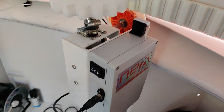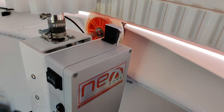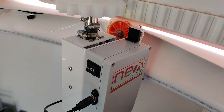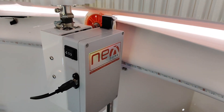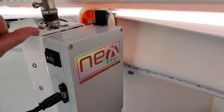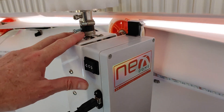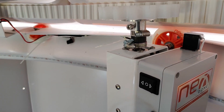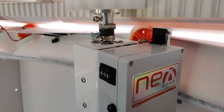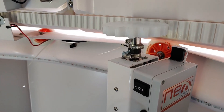The other mod I had to do was on the magnet sensor — it was just too far away from the track. I 3D printed a little spacer to bring it up closer to the track, and that helped pick up the home sensor. I wasn't doing that before and it was one of the issues I had when trying to set up the dome alignment. The other issue with the track was the original spigot where it sits on the gear was too short, sitting away off the bottom of the track. I 3D printed another spacer and stiffened it up with some jubilee clips, and that seems to be behaving itself. I might get somebody to knock up a proper steel one later if it works out fine — I'll use those dimensions for a permanent one.